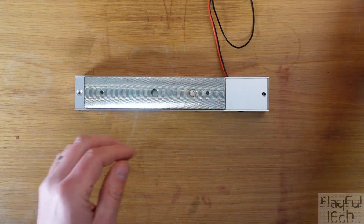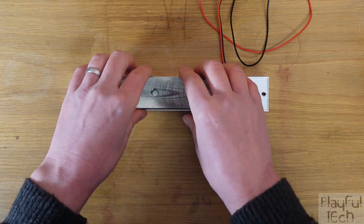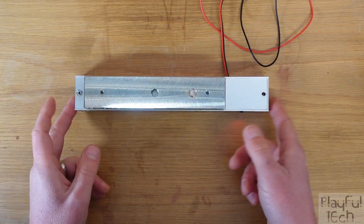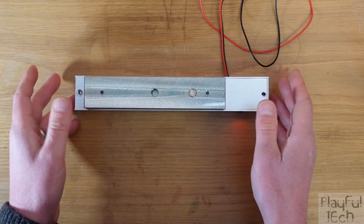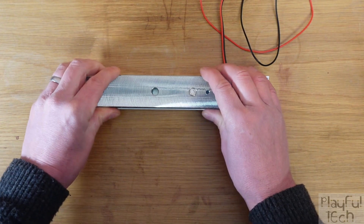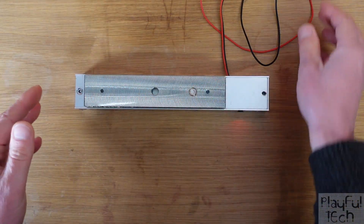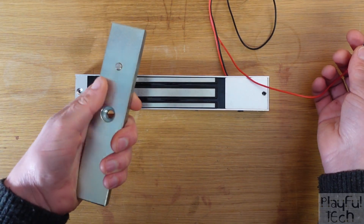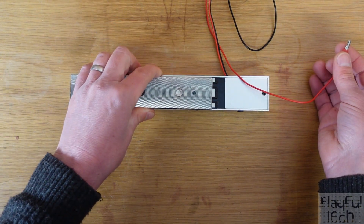That's how you'll get the strongest hold. When the mag lock is powered up, the attractive force between the mag lock and the armature will keep the door held securely in place. The strength of mag locks is measured in pounds or kilograms, and this lock is rated at 600 pounds, or about 300 kilograms of holding force. So a single one of these locks is generally sufficient to hold a single door closed — there's no way I can budge that armature plate off that. This style of mag lock is described as a fail-safe mag lock, meaning that if the power is cut for any reason, the lock releases and any door that it was securing opens, so it's impossible for anyone to become trapped behind it — a crucial safety consideration in the event of a power cut.